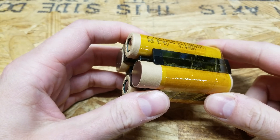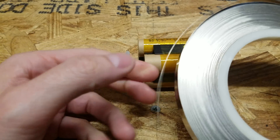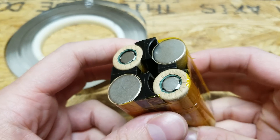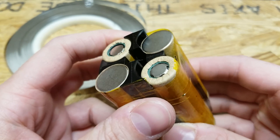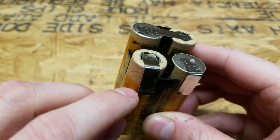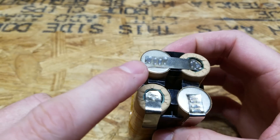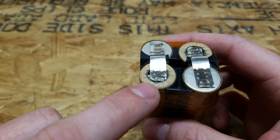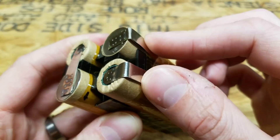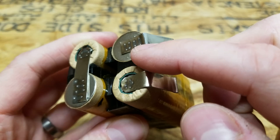To get this battery wired up I'll be using standard 0.15 millimeter nickel strip. Since this is a high current application, I'll actually be putting two layers of nickel strip just to double the current carrying capacity and reduce resistance. I completed the spot welding — I started with the main positive, wired all four cells in series to give the nominal 12 volt pack, through to the main negative. I also welded two tabs on here so I have a surface to solder to without having to solder directly to the cell.